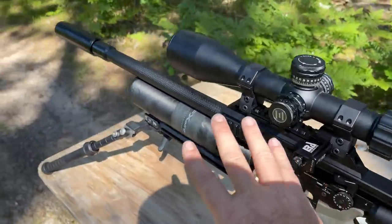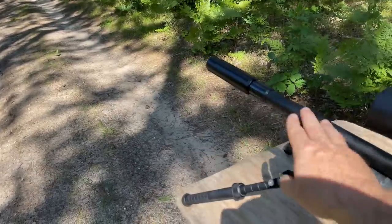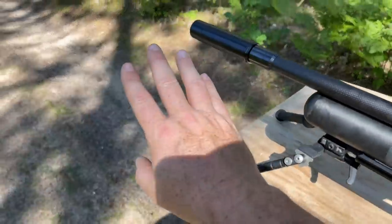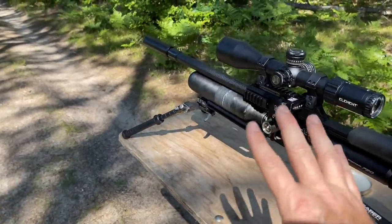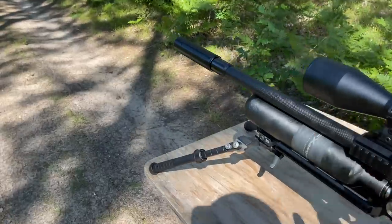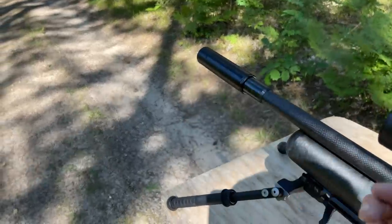What I'm doing right now is changing the point at which, as that barrel is oscillating, it's leaving the muzzle, at the exact same velocity, by shifting this weight. And in my mind, that's the right way to tune a gun for precision, okay? Tuning with velocity is the way we've been doing it for years, right? And it works because eventually, with the feet per second leaving that 700 millimeter barrel, at some point you're going to time it just right.